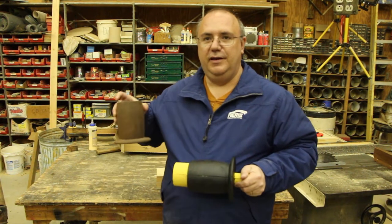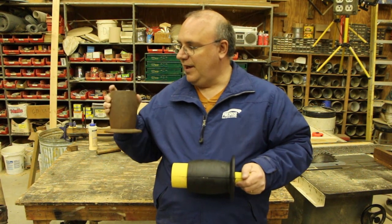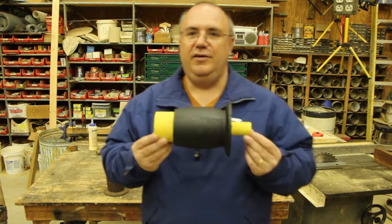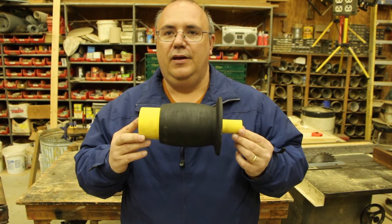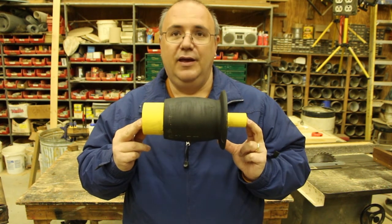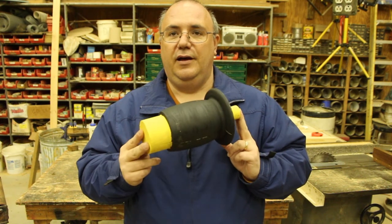This is the old pulley — it was actually damaged on the machine and needs to have a new one built. So we're going to build the wooden pattern and have that cast. The pattern is here and we've painted it now. It's not just bare wood as it was before, and now that it's painted you can hopefully see what's going on with the core prints and the core box. The black part painted on here will actually be the pulley portion of the pattern.